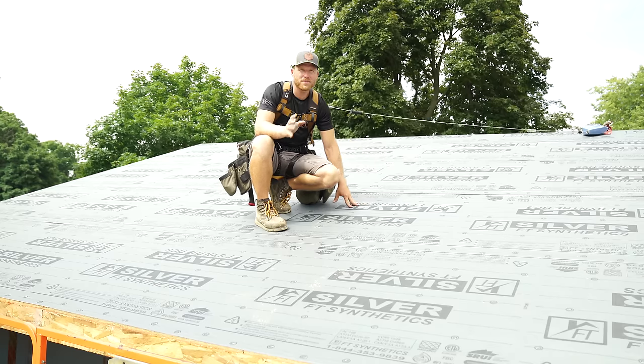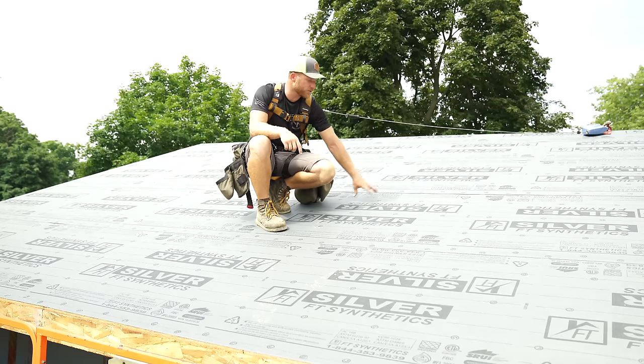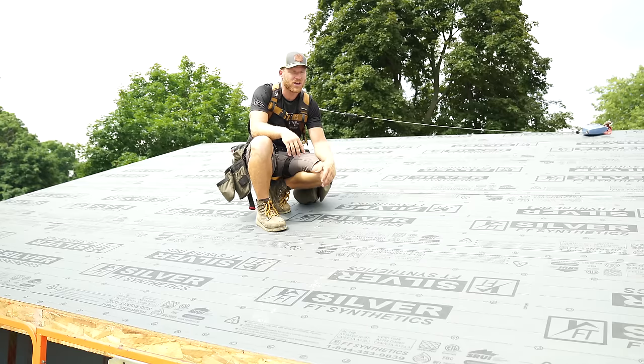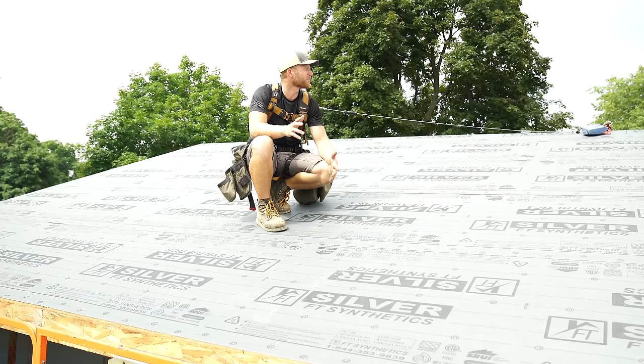All right, now that we have the dimensions of our building, our roof determined, before we lay out our marks, if you haven't already, which we have, check square. We had to do that in order to sheathe it, and everything was like perfect, so I feel really good about that. This is where you would want to check a triangle, like a 3-4-5, or use Pythagorean theorem and some simple math to determine your eave line perfectly square to your end gable line, which we could just do just to confirm it, just to make sure.